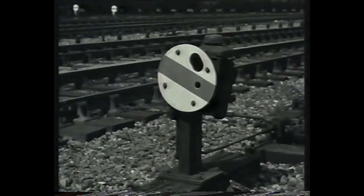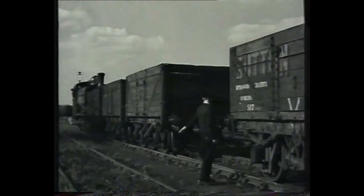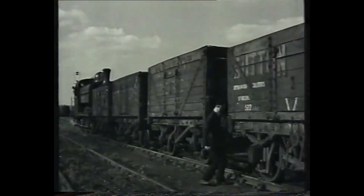It's simply a small stop signal at ground level called a Tommy Dodd or Dolly. Then there's the repeater signal, usually of the banner type, set where the main signal may be obscured from some positions by, say, a bridge. Coloured lights, in which the semaphore arm is dispensed with, show a bright hooded light and thus give the indication by day in the same manner as at night. Nor must the importance, especially in shunting or unusual operating, of hand signals be forgotten. Though perhaps the most important type of special signal for use at unusual times is the detonator — the fog signal — which we'll use now to bring us to the end.